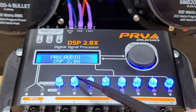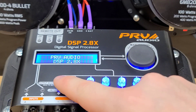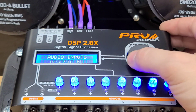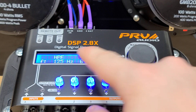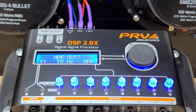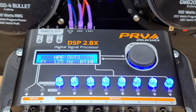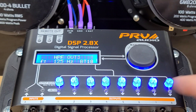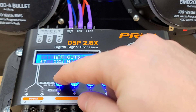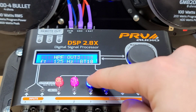These here are hotkeys. These are for the outputs. They have two functions. A quick press will go into the audio processing. So you can see output 1, 2, 3, 4, and so on. Anytime you're inside of a menu, you don't need to scroll to choose the output — you just press the button. When the buttons are blue, the output is activated; it's on and sending signal out. When you hold the button, it will turn red and it will cut the signal to that output.